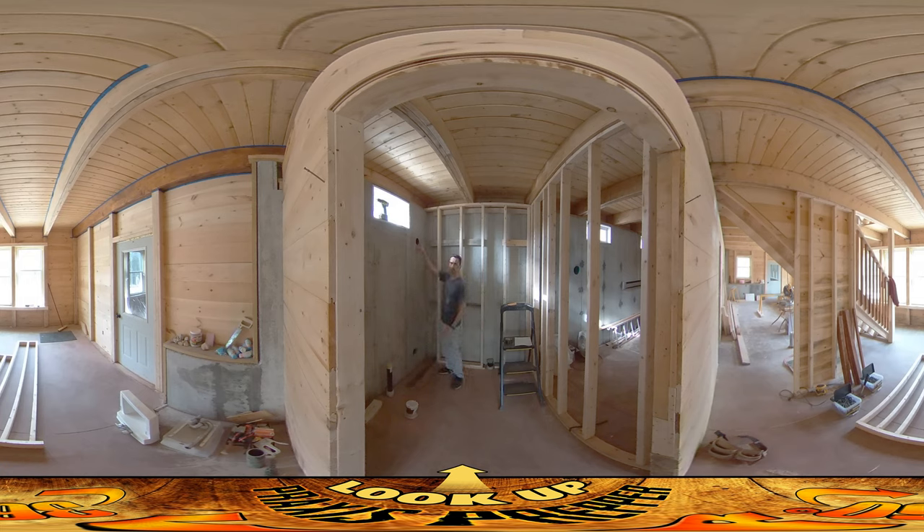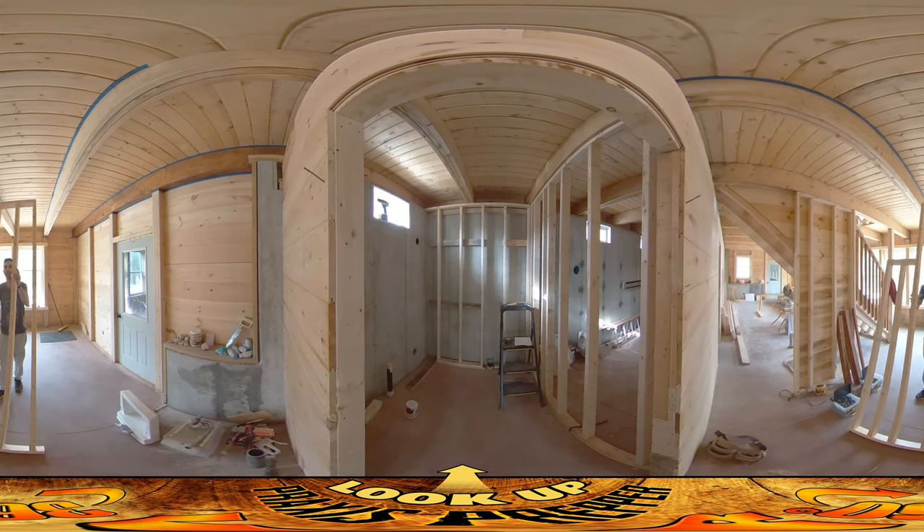I've been looking at where this was placed — this is the gray water out that's going to go out to the greenhouse. We're going to do that later and I'm not exactly sure with where the vertical studs needed to be, how that was going to work with this. I've got the sections built behind you — it's lower in this section because it's going to go around that window up there. I was able to pre-measure a lot of stuff, but some of it was a little confusing in terms of where things are going to lay out and whether one of these studs is going to be a problem for that gray water out. The studs are predicated by the plans for the shower unit, but I'm just having some trouble visualizing how this works.